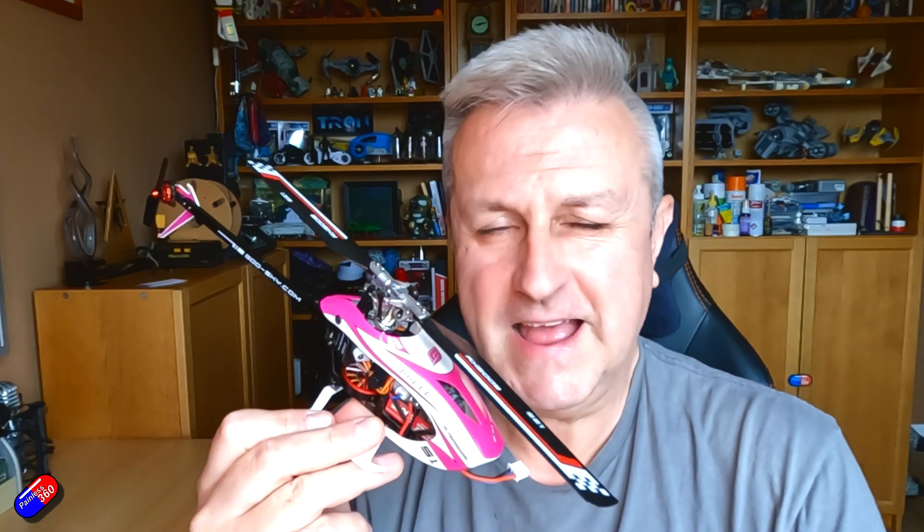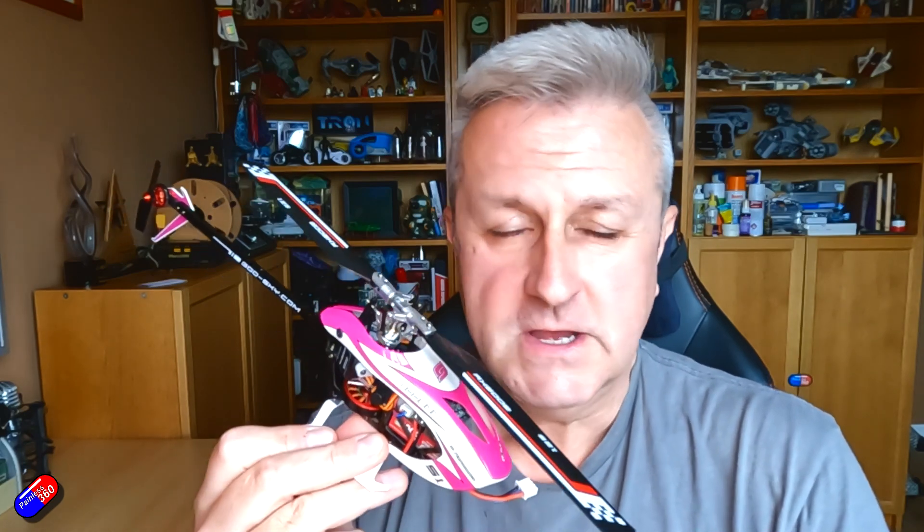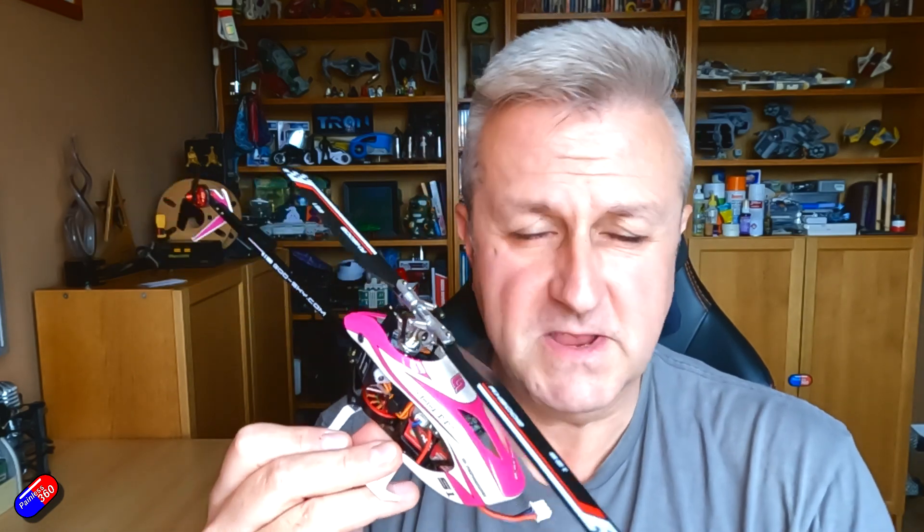However, I'm really struggling to find how you set the radio up. The reason is, if I set it up as I did before with the HTX on ExpressLRS and use Channel 5 for the arming of ExpressLRS like we normally would, that means that the Channel 5 stuff — which I think normally sets the modes — means that in only one mode for the helicopter, ExpressLRS is going to be turned on. And that doesn't seem to make sense to me.